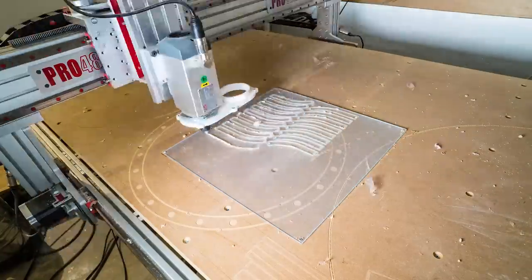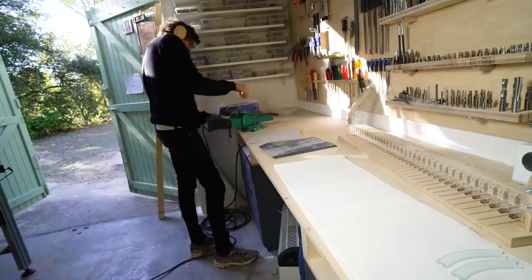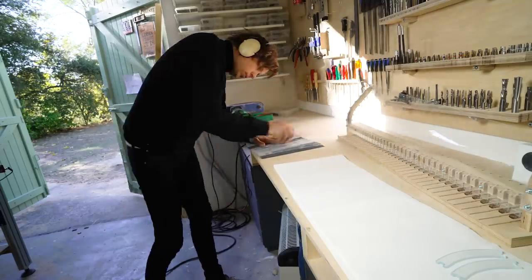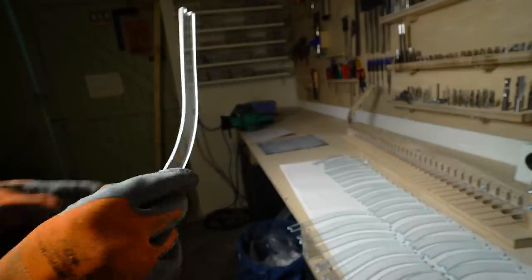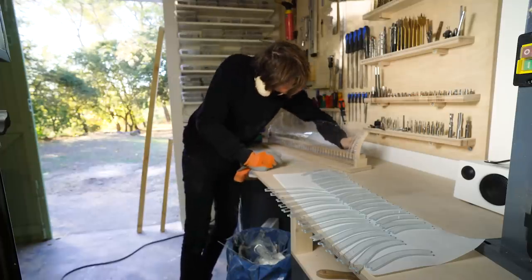After I had all the polyacrylic CNC'd, I had a lot of manual work to get everything to fit together, and this was because I forgot to add in tolerances in the CAD design. So with more experience I will remember to add the tolerance in the CAD design and I can cut things on the CNC without having to manually resize them to fit afterwards.